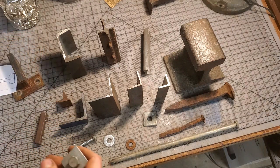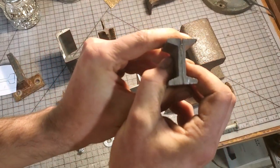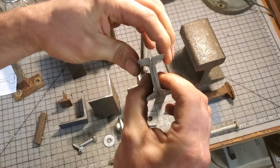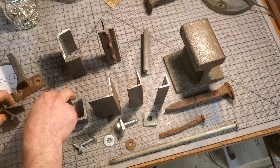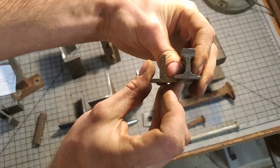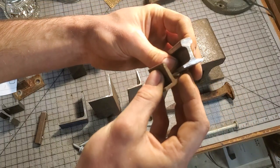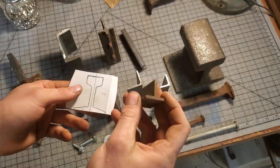In terms of other profiles you can achieve: if you're not averse to a lot of welding, you can take two channels, put them back to back, weld them, and end up with a narrow I-profile, which gives you a bit of a wider head at the top. You can also take T-bar and weld a small rectangular flat to the top to build up a profile similar to the 1-inch rail, or with a bigger T-bar, weld up something closer to 12-pound rail with a bigger T and a bigger flat rectangular bar on top — though that takes welding over the whole length.